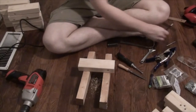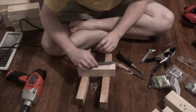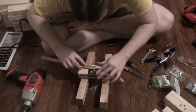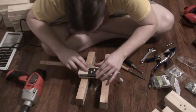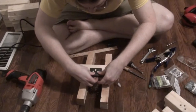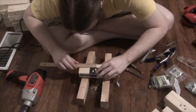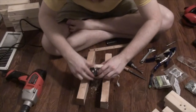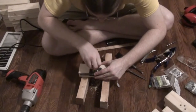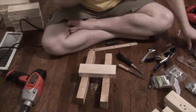The way these need to mount is on 14 horizontal cross pieces and a bunch of others — 32 total. I need to install threaded inserts which go into the wood, fasten to the wood, and have a machined hole on the inside so I can screw machine screws into the insert and have the sensor brackets against those. This is a component I might need to unscrew and re-screw, and I don't want to be doing that into bare wood. Screwing into wood is ideally only done once or as few times as possible because wooden holes tend to strip over time. That's why I wanted the threaded inserts.